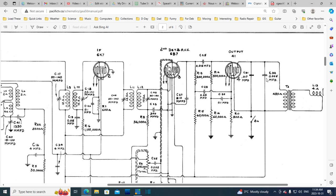And its job is to quell any high-frequency harmonics, audio harmonics, that have been generated within this tube. And I guess this guy, too. So this one in particular can produce harmonics. You don't want to hear them. Harmonics are high enough we can drain them off here. Actually, they could be above your hearing. So the effect this one has, you may not notice it. I suppose if you put too big a capacitor in here, you're going to muffle the sound, you're going to reduce the treble, I would think.